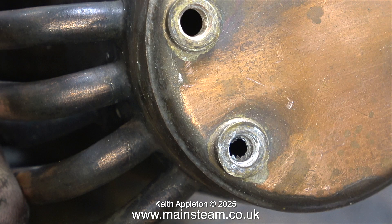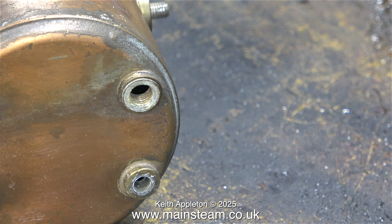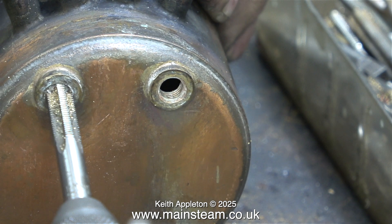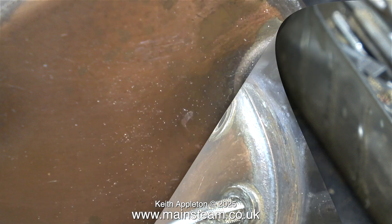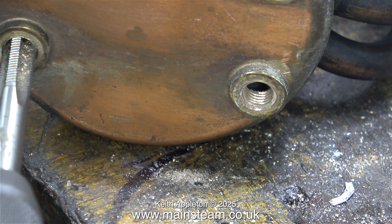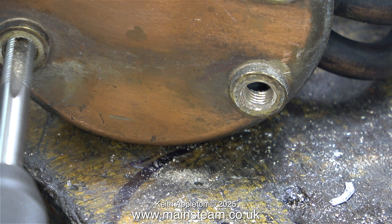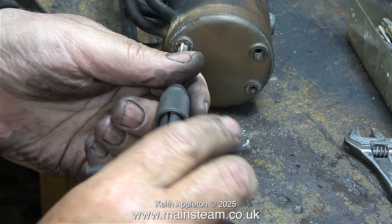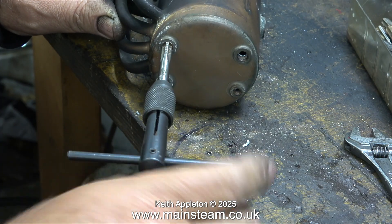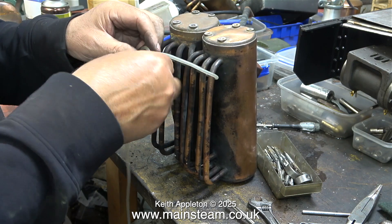There's a lot of limescale in the bush as well. Out of curiosity, I wanted to find out how good the threads were, so I used a tap for this. The threads in the bushes for the water gauge and the check valve are quarter by 32 threads per inch. Here I'm checking the integrity of the bush by using a quarter by 32 threads per inch tap, and the results are encouraging. The metal particles on the tap are not from this job — they're just on the tap from a previous tapping operation. As you can see, the once limescale-encrusted boiler bush is now nice and clean. I checked the other ones and the tap went in without doing any cutting, so that's good news.